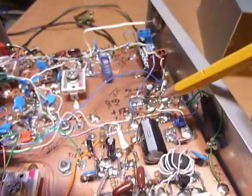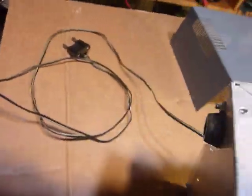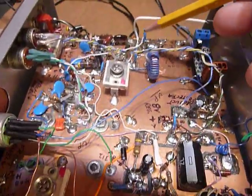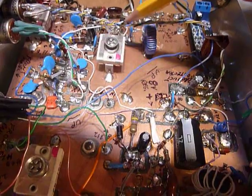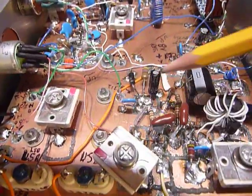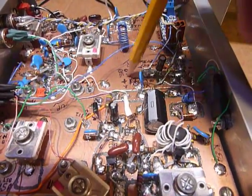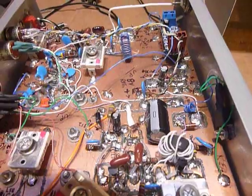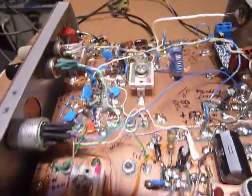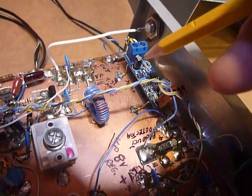And what else? So we come out of this third SBL1 mixer. Is there 3 of them? Let's see. I gotta look. No, there is 2 SBL1 mixers. Excuse me. There's one that converts the 915 to 3.395 back here. There's an amplifier for 3.395, an MC1350, and I'm running back through this stuff. Then you come into the detector, which is a product detector, SBL1 doubly balanced mixer, and that then the output feeds an LM386 audio amplifier, and this is already built on a little circuit board.